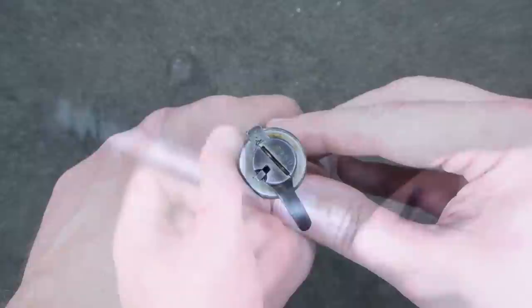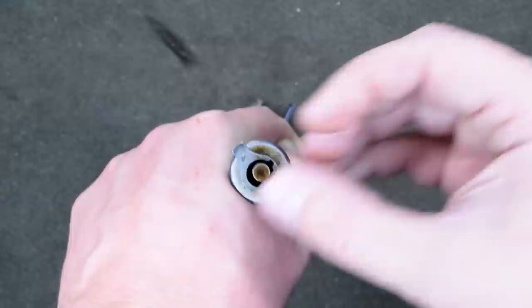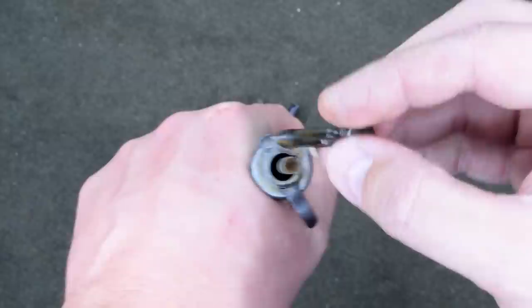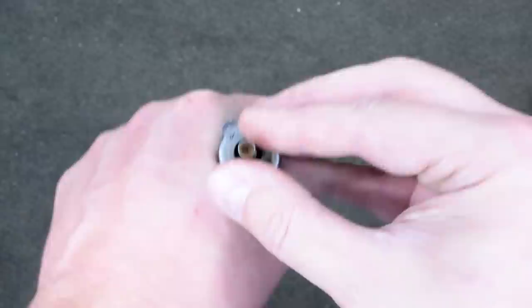Pushing all the way down on that piece fully extends the central firing pin, pushes this yoke all the way out of the action, and look, it falls in half. It was actually two perfectly machined pieces, and they could only be freed by both unthreading them and lifting them high enough. Now, ideally, you would push down and then unthread all this, and that way you don't put any weight on those last threads, but I really want you guys to see how confusing this could be for someone trying to explore one of these rifles 100 years later and not knowing. From here, we can let this up, and this whole assembly will come apart.